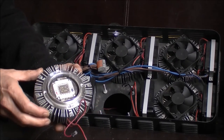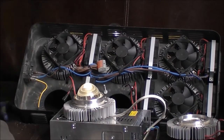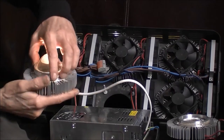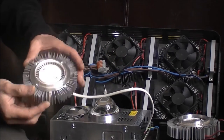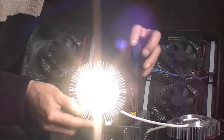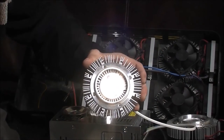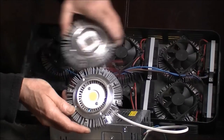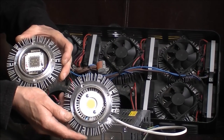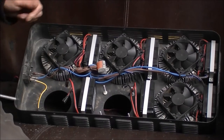Here's a detail of the holding ring for the lens assembly. The fans are only held in by two screws. This is one of the same COB units but fitted with one of the new Gen 3 Luxian LED replacements that we're using, being run from a variable voltage 36V power supply used for testing purposes. As you saw, as soon as I turned it up the iris had to shut down on the camera, clearly indicating this is a much, much brighter output. These are absolutely tiny — that's sort of the size of a half-penny piece. The new COB holder is a two-screw holder, where the old COBs were four screws direct into the heatsink. We're just going to complete the dismantling process here.